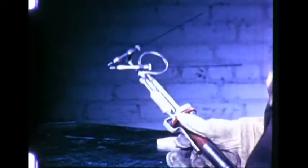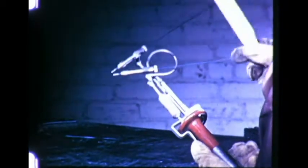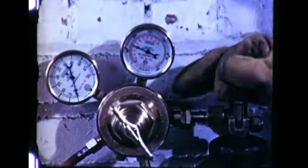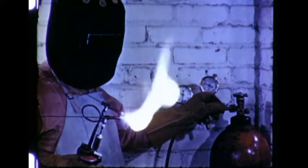With this current setting, we are using electrodes 1/16th inch in diameter. They are given their maximum extension. The hydrogen is turned on. The arc is struck, and a check of the hydrogen flow is made by observing the arc with the electrodes about 1/16th inch apart.